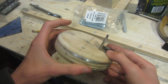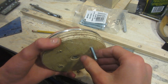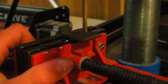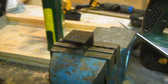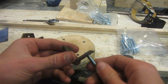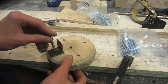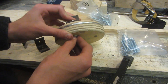Once that's drilled, an M6 bolt can go through and each of the 90-degree pieces of steel can be held on by a bolt. I'm not going to clamp them up yet though because I still need to drill and tap an M6 hole here for another bolt to go through. Now each L-bracket has an M6 threaded hole which can accept M6 threaded bolts. Using the non-threaded six millimeter holes I put the M6 bolts through and attach them using nuts and washers on the other side.